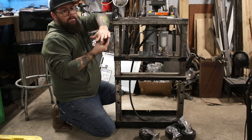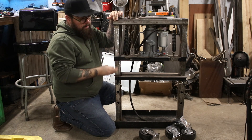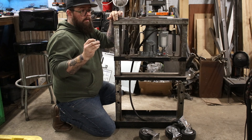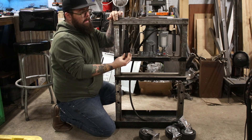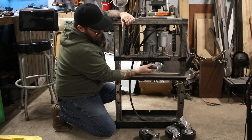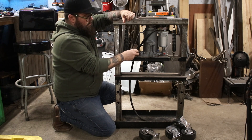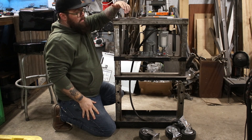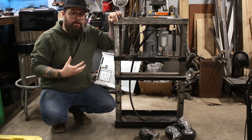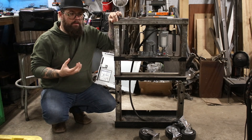I have a bunch of one-inch nuts that I can weld things to and bottom out against the other end of this bolt, so hopefully none of the pressure will be on the threads. I figured I'd be safe and get everything to bottom out on the actual body of the bolt. I need to make some sort of plate here at least to start with — this will allow me to make different attachments. The only issue going this route is that I need to be cautious of the orientation of whatever I weld to these nuts, since it's threaded on it's going to spin. I don't have a mill or lathe, so I'm really trying to not get into machining any collars with set screws.